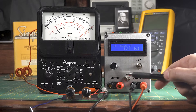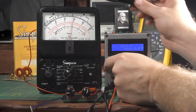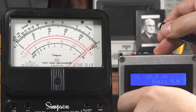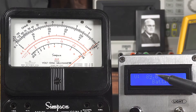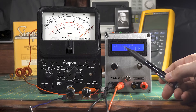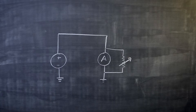But what happens when I use the voltage source to drive the ammeter? I can clearly use a voltage to drive it, because a voltage across the ammeter causes a current to flow through it. However, it only takes about 89 millivolts to drive the needle to full scale. Based on the operator's manual, we want 250 millivolts to cause full-scale deflection — not 89 millivolts. So how do we fix this?